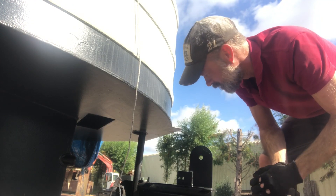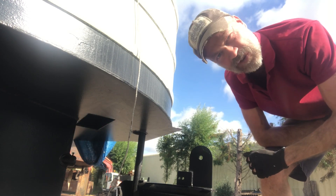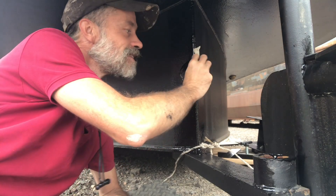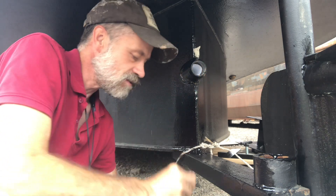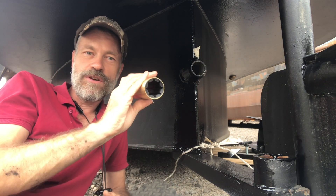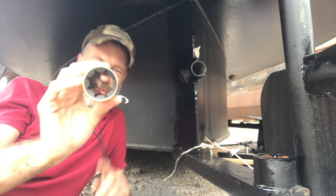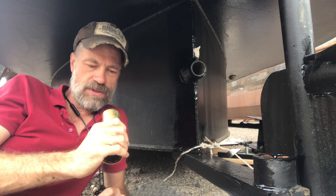Hopefully that's enough, because you can't get it any more out of the way, and as we well know, you can't actually move it without getting a forklift around. I need to take the masking tape off from when I did the blacking a while ago. So this is the stern tube, and inside there goes the cutlass bearing — a bronze tube with some rubber bushing in there. Those slits are for water to go down, which lubricates and cools the bearing.